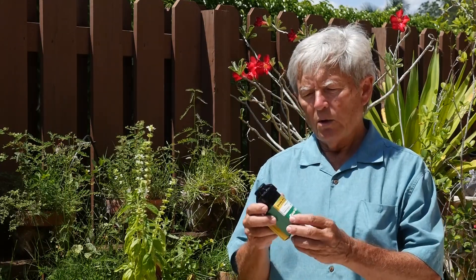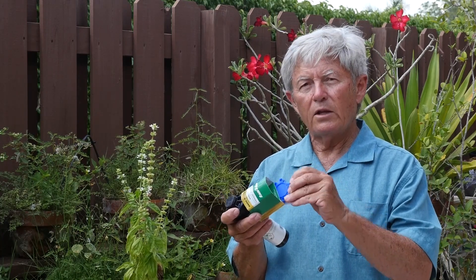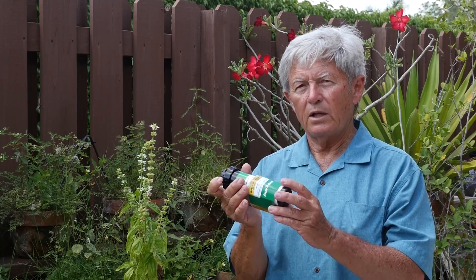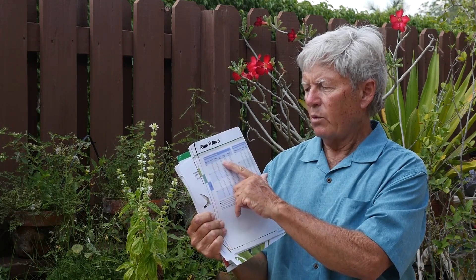To show you how square or equilateral sprinkler layout can assure excellent overlap and head-to-head coverage, I picked a rotary sprinkler with a 20-foot radius, of which several manufacturers have examples. The one in particular I have is a Rainbird 3500. It comes complete as a kit of interchangeable nozzles, so depending on our radius requirements and available pressure, we should be able to get a 20-foot radius. The manufacturer's sprinkler table tells us that for a particular pressure and nozzle, there will be a certain radius, and it will also tell us the flow and precipitation rate. So let's go design.